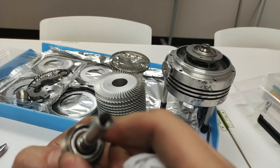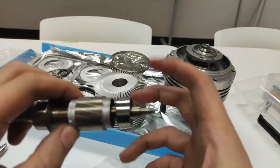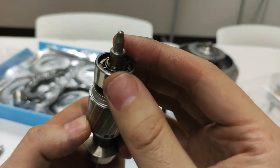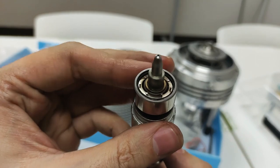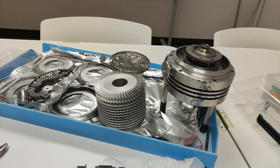This is also pretty easy. The top bearing — it's pretty good, there's just a bit of play, probably I'll change it but probably not, we'll see. But this one — yeah, sounds rough. See the stoppers are getting out, and this is how they're supposed to look — this one is shot. To remove it I think we'll need the puller, so it's good that I have one. Always good to have a gear puller because bearings sit quite tight.